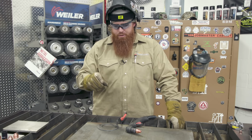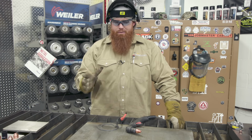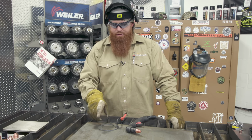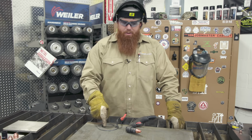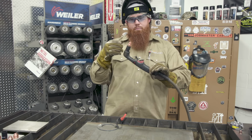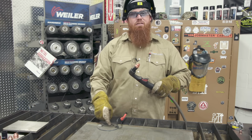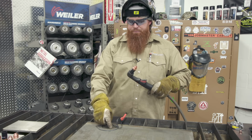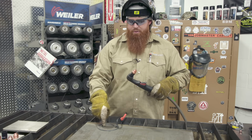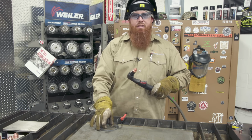So the first thing I'm going to do is I'm going to cut a hole in the plate. Okay, so the piece that comes out of the middle, I don't care about it. I want the clean cut quality to be on the plate, not the piece that's falling out of it. In addition to that, depending on what type of template that you're using, remember we have just on this one, my personal torch size, yours is going to be a little bit different. I have a 3/16 offset, okay? So whatever that is, I'm going to have to double that for a circle, so the diameter. So once I get done with this, I should have a hole that's 3/8 less than the template that I have right here.